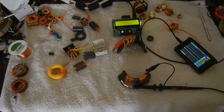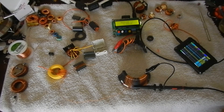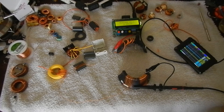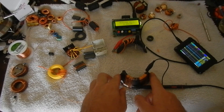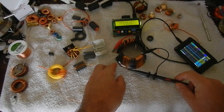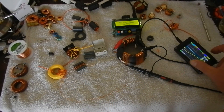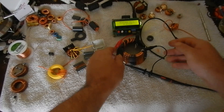If I pull it right away until there's no more effect, we drop down to 5.8 microhenries, so this one doesn't change a lot when you put the two halves together. But if I press this button and go to measuring a higher inductance, we lose some accuracy and range, but it still says about 6 microhenries. Look what happens if we bring them closer together - we get much more coupling and a much slower waveform on our scope.